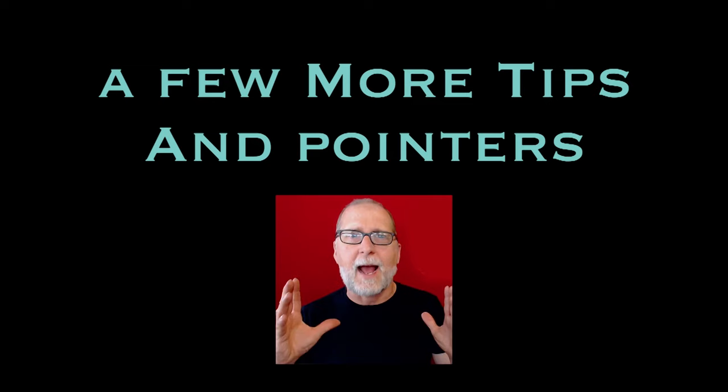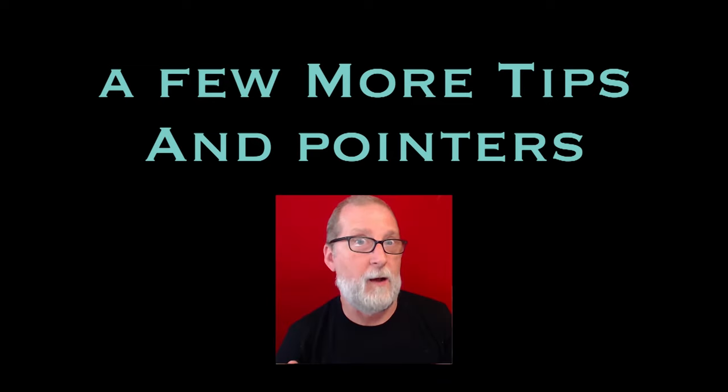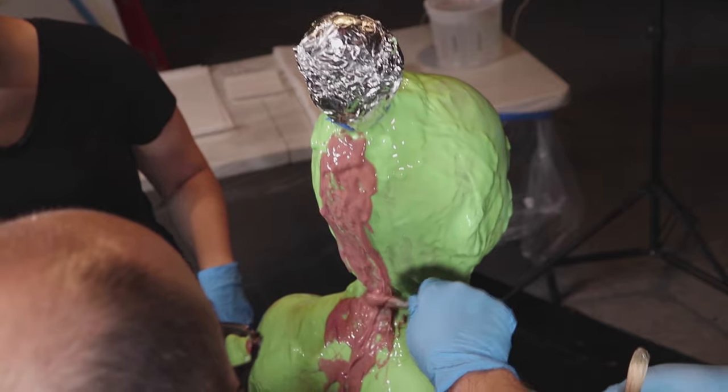Before the second layer is applied, the first layer needs to be firm to prevent sagging. As we go back in action, we'll see that the head casting ninjas will be adding the border strips. Also, the red pigment in the second layer batch gives a great contrast to the first coat, helping to identify where the second coat has been applied or needs to be thicker. Now back to the action.